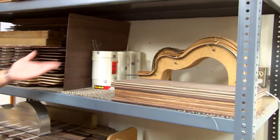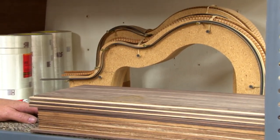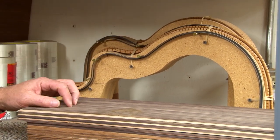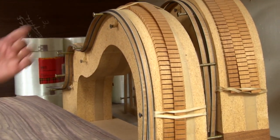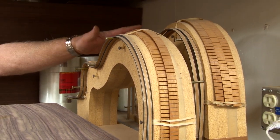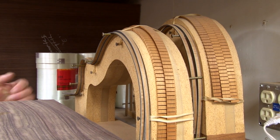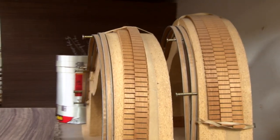For the kerfing, we mist them with water, put them in side benders — we have aluminum side benders outside. These are bent per their work orders. The builders are working on six to eight guitars at one time because there's so much dry time. They'll be bending sides, binding a guitar, working on a top, bending the back and sides, gluing the backs together — all these little different steps, and each builder has to do every piece himself. You've really got to prioritize your workflow.